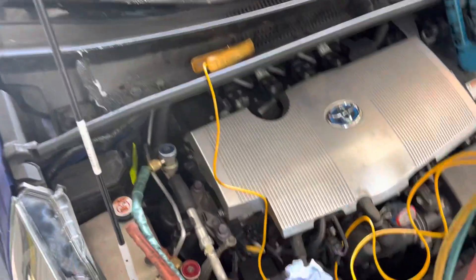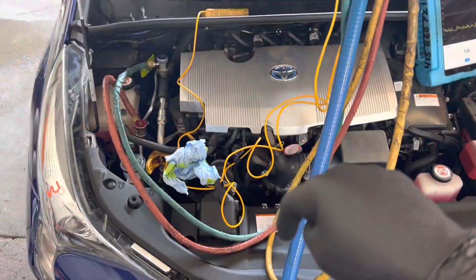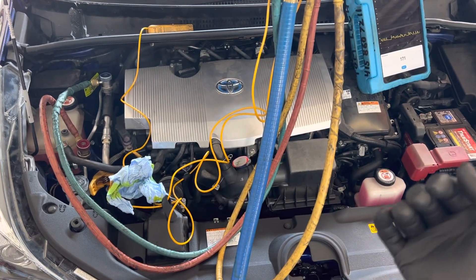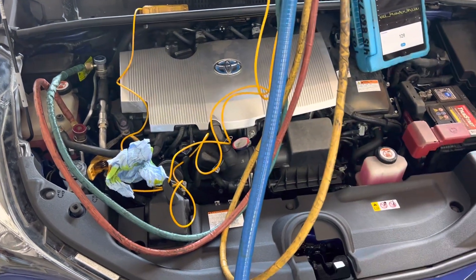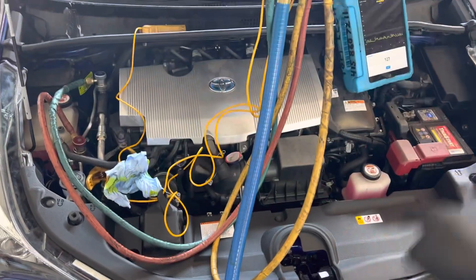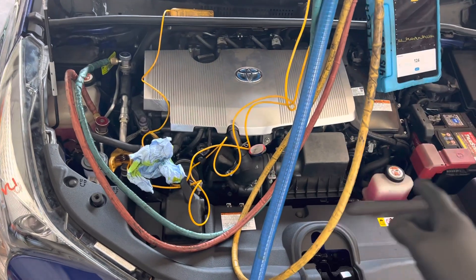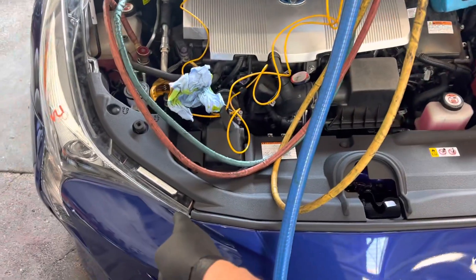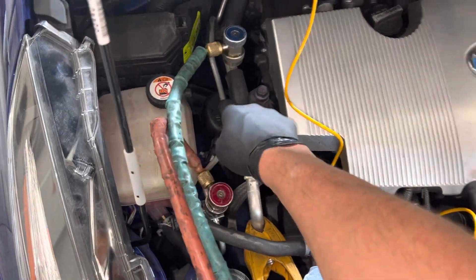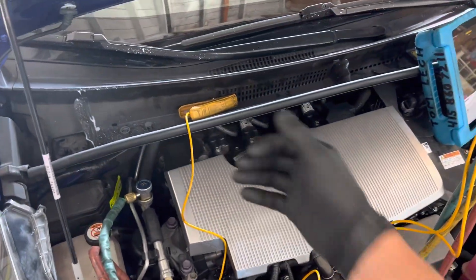So I've got to check for a leak back there. You might think you're getting off easy sometimes when you work in a mechanical shop and the body shop delivers a car for you to recover. You go, 'Oh, all I have to do is leak check the two front fittings.' Well, theoretically, you should check everything. But everybody likes to be lazy and they go, 'I'm just going to check these.' They forgot — and may not know — that the body shop changed this line and they could have damaged the O-rings. I can tell you one thing: they probably didn't change the O-rings when they took it off.